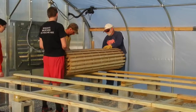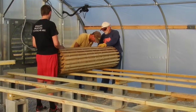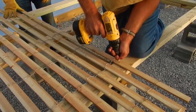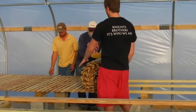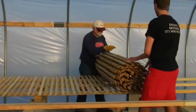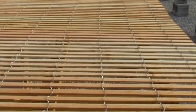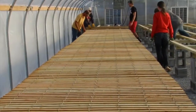Get the roll of lath and set it on one end of the bench frame. Allow one foot to hang off the end. Secure this end down with one deck screw per construction timber — three total. Then unroll it slowly down the top of the framework, one foot at a time. Use three deck screws to secure the lath at the far end of the bench, then install screws throughout the bench framework strategically to keep the lath in place down the length of the bench. The bench is now ready for use.